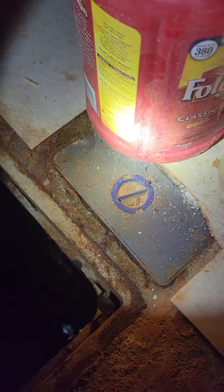This is a clean-out port, and there are a couple of those throughout the basement. The problem is they have obviously not been cleaning those out. When a home has iron bacteria like this, they need to put clean-outs everywhere there's a bend or a corner so they can get in and hydrojet those lines out to maintain them, because the iron is coming from the soil — so the system is going to be constantly trying to manage it.